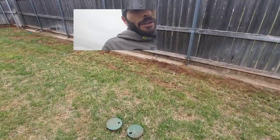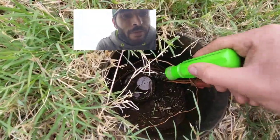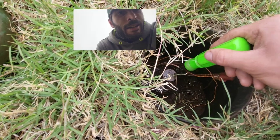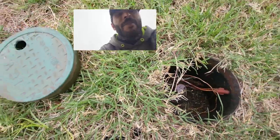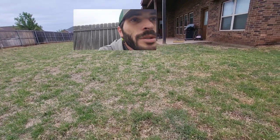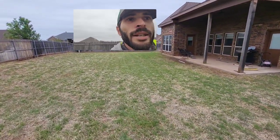This is where I take my screwdriver. I'm going to go through each zone and turn them on from the manual bleed screw, which is right next to it. You can also turn it on from the solenoid, but I prefer the manual bleed screw. Just a little turn — it will leak a little bit and that will open up the valve. All I need to do is figure out which one of these four zones operates the zone down there. I got it right first go. If I wasn't lucky, I'd turn that one off and go to the next one. So I know my troublesome valve is that one on the right.